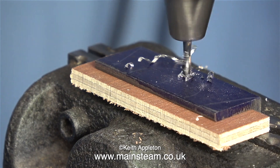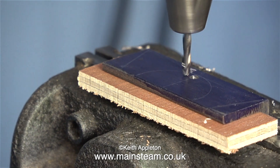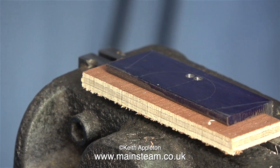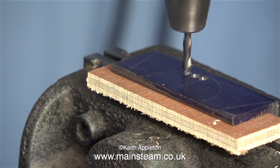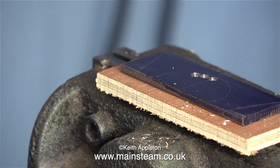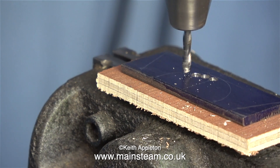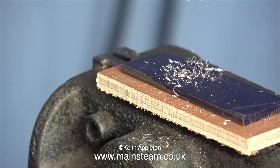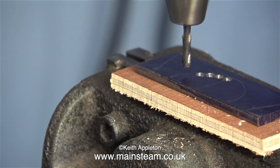In this clip I'm drilling a lot of small holes around the inside edge of the line scribed on one surface of the piece of angle. I'm showing this very old-fashioned method because I'm aware that many people out there do not have a milling machine. The twist drill I'm using is very small — only 3/32nds of an inch. It looks much bigger on the video because it's highly magnified, but it really is small.